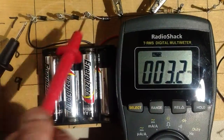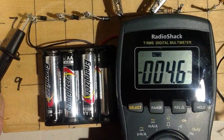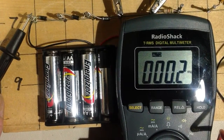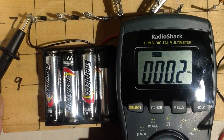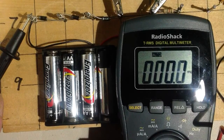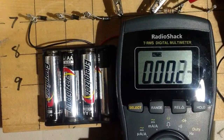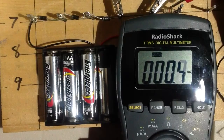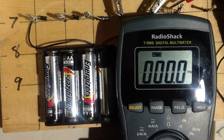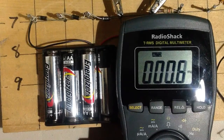So this makes for a very good voltage divider in increments of about 6 tenths of a volt. You could just keep on adding more and more of these diodes in series until you had 10 of them — then you'd get the whole 6 volts, presumably. Now you wouldn't want to dead-short any diode across the battery or you'll burn that diode out. You've got to have a load with a finite resistance that will not subject the diode to more current than it's designed to handle. I picked a decent resistance of 1,000 ohms, actually 980 ohms, so that it wouldn't result in destruction.